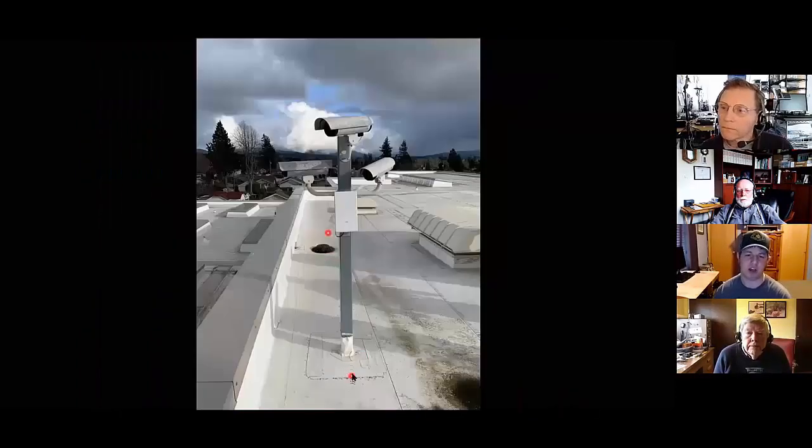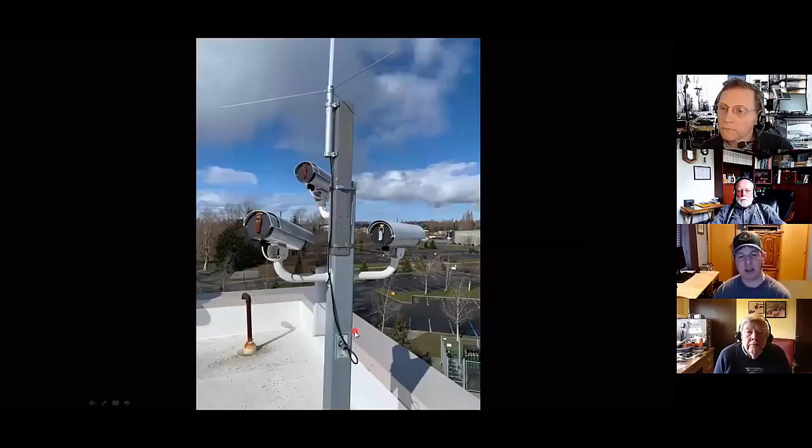On the rooftop side of things, the hole actually brought us inside of that piece of structure, and then we were able to mount our antenna system to that. They already had this little electrical box cover plate. We mounted a little pass-through, put a nice little drip loop in it, and ran up. This was a bracket the college actually had that we utilized, and we put a nice medium gain base antenna on it.